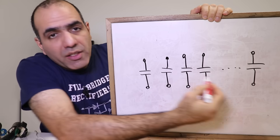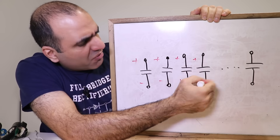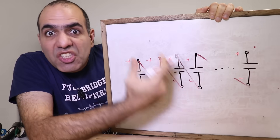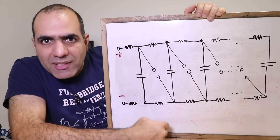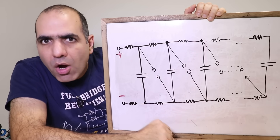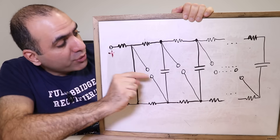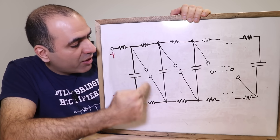The way it works is: imagine you have 10 capacitors and you go around and charge them one by one to say 100 volts. Then you connect them all in series. Now if you measure between the end and the beginning, you will have 10 times 100, or a thousand volts across it. And that's what the Marx generator does. You have these high voltage capacitors, say one nanofarad, initially parallel to each other through a bunch of resistors of one megaohm. When you turn on the supply, the current flows and charges all these capacitors, ideally to the same high voltage. Now all you need to do is put all these capacitors in series to get a massive voltage. What Marx generator also has are these spark gaps.